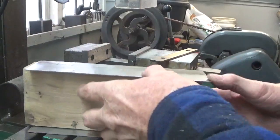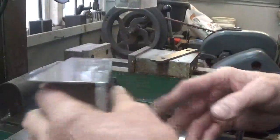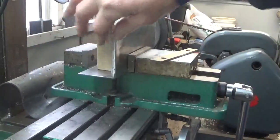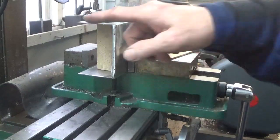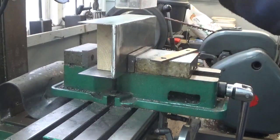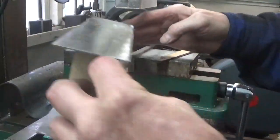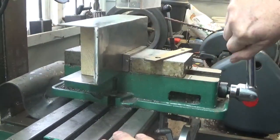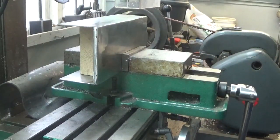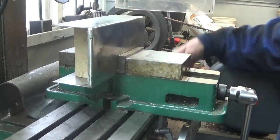Okay, so here's what I do to make this work as easy as I can. You need something in here to keep this rigid, because when you put it into the vise, the only place it's being held is the top and the bottom. So any kind of drilling may make this bend back or forth. You know, you're pushing down on it, so it's going to make it bend in. So this wooden block in here stops that from happening. So I put this down and then tighten up on that a little bit so that it's good and snug. And then what I want to do here